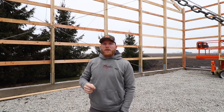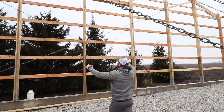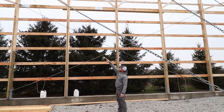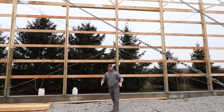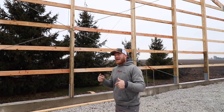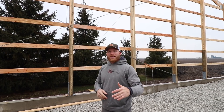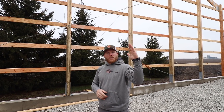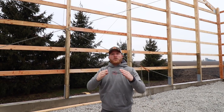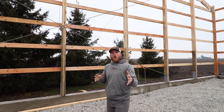The first thing we like to do before we put any trusses on is what we call our X brace. We take chain from the top of the post where our bottom cord of the truss is going to be and bring it down on a nice angle. We try to keep that angle less than 45 degrees. If you're using a wooden framing member, anything greater than 45 degrees — the steeper that angle gets — the weaker your bracing is going to be.